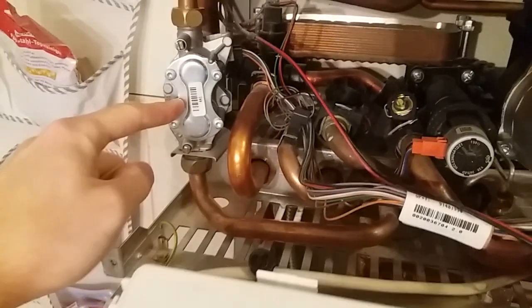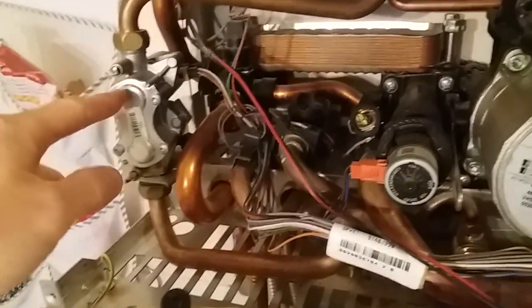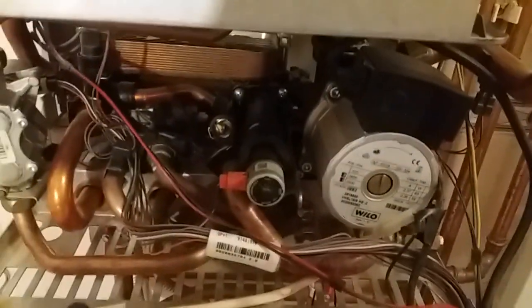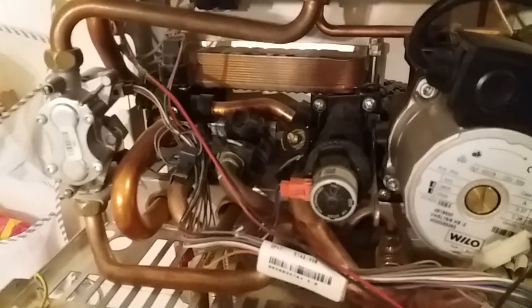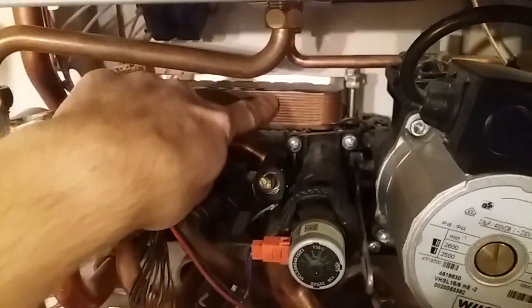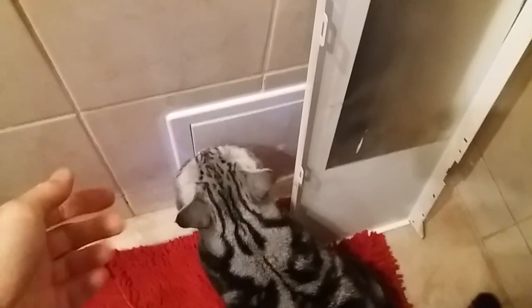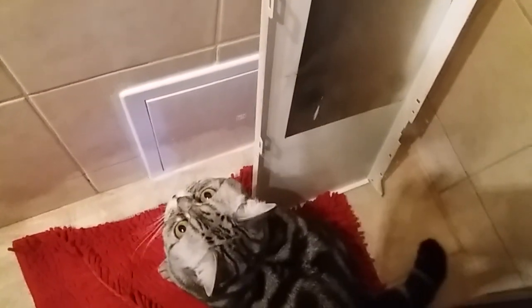There are probably some solenoid valves, and also maybe a stepper motor valve for the gas, and a thermostat water pump to circulate the water through the heaters. It also heats the water in the tubs and in the shower. So it's a double function — it has a heat exchanger here, water to water basically. Here's the space where it heats the water in the exchanger.